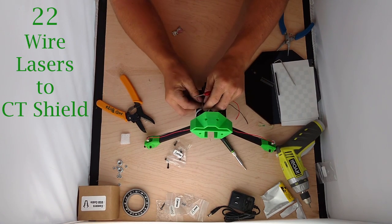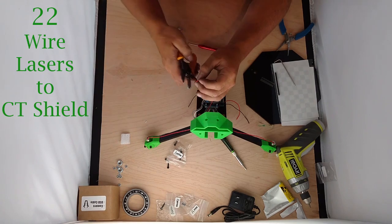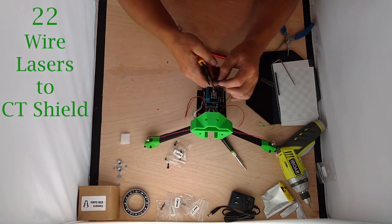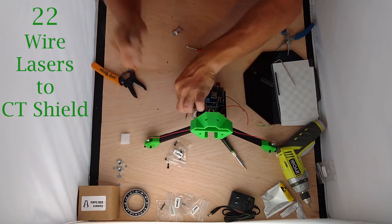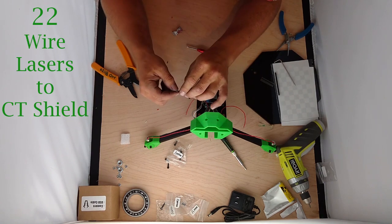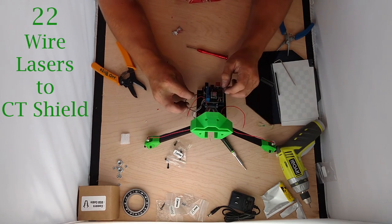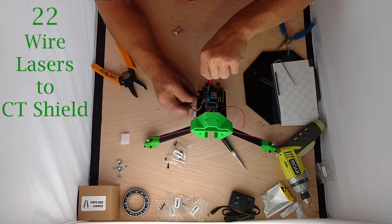I want those to rest out of the way in the future. Now take your lasers — I'm going to do the same thing with these wires, just open them up a little bit to give us a little more room to clamp to. Take these two wires — the two grounds, which are the blacks — and just twist them together. Make sure they've got a nice twist on.